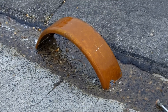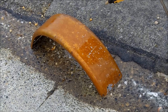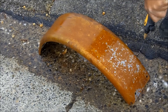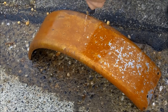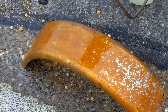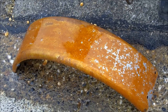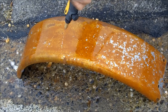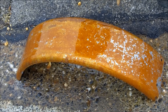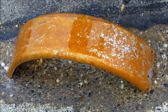Got to let it sit just for a minute to do its job eating. Just going to drip a little bit more on here. The acid seems to have some sort of energy in it, and as it kills the rust it uses that energy up, so you have to back it up with a couple of layers — just dribble it on there, it doesn't take very much.